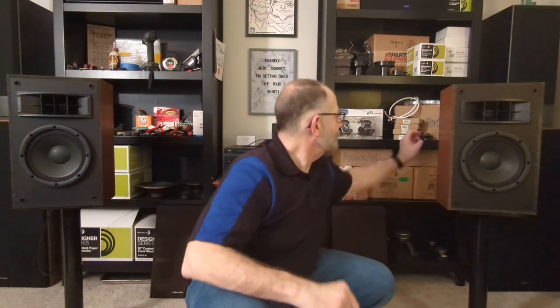Can only be the crossover or the tweeter. My money would be on the tweeter. Like I said, it was a super cheap tweeter. Main reason I got it was because of the look of it. And I do have a couple of ideas. I think what I'll do next video is repurpose the RCA tweeters. These were pretty loud, and I think that I can easily glue these on the back of those horns, so I can basically take off the piezo and put this in there and have a regular tweeter going. We'll see if that fixes the problem.